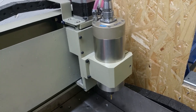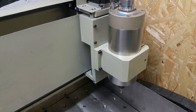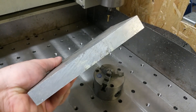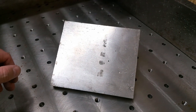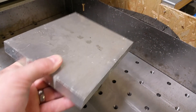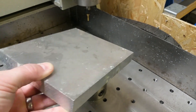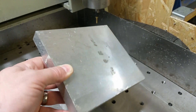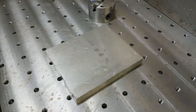For me, buying one is absolutely not an option because I want to make it myself, especially now that I have the 6040 CNC router. I'm going to use this aluminum plate, which is 20 millimeters thick. You could just as well use MDF board or some other kind of harder wood — it doesn't have to be aluminum or steel. But I had this plate, so I'm going to use it, and it will also be perfect to do some test milling afterwards to see if we get more stability and less vibration.